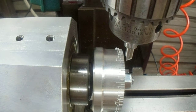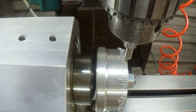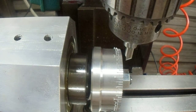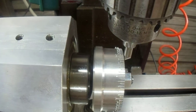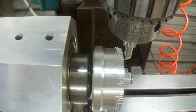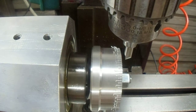We'll move eight clicks around here. This half-a-thousandths mark is only one-eighth of an inch long — twenty-six, that's close — and move eight-twentieths more. This mark is three-sixteenths of an inch long, the full one-thousandths mark. Go in here, one-sixty, eighty-seven, back off, go around again, and there's a minor mark which is the half-a-thousandths mark. That's how that's done — just keep going until you get all the graduations engraved around the dial.